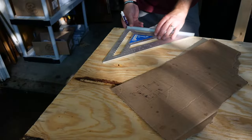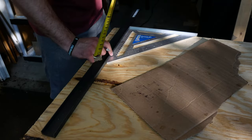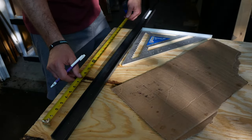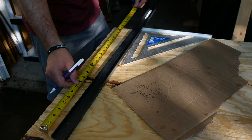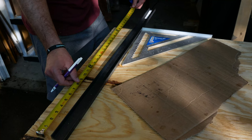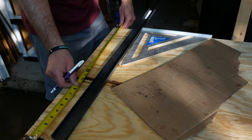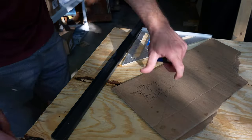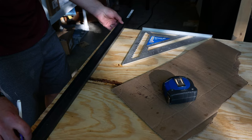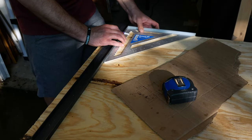So you may be wondering why I decided to put plywood underneath the butcher block. Part of the reason was I wanted to put these cantilevered pieces of metal in between this and the butcher block to help make sure that the butcher block had extra support, especially over where it was going to be overhanging the counter, so that way people could sit and eat at stools.